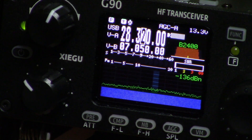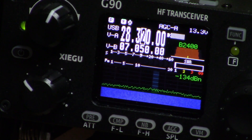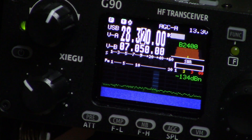When you're updating the radio, it's first going to delete all the existing files, and as soon as you start that process it goes into a booting section — you don't want that to occur. So when you're in the process of upgrading your firmware, as soon as you turn on the radio you need to hit the spacebar on your keyboard. That aborts the booting, because if you don't, it's not going to go into the sequence that allows you to upgrade your firmware.